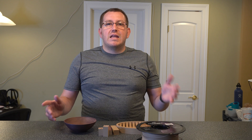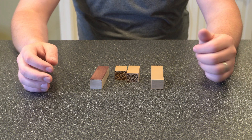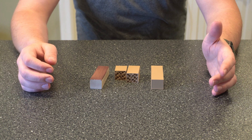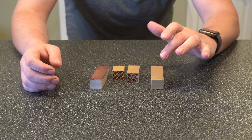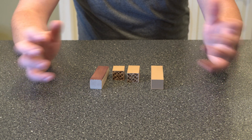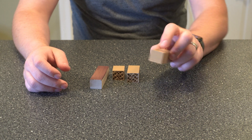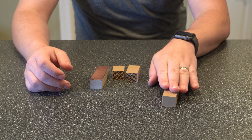Make sure you guys hit that like button and subscribe. The first example I have here is three rectangles. They're all printed on the same batch, standard PLA print settings, 0.2 millimeter layer height. I've got two layers for the shell thickness, and really everything else is just standard for a PLA print. This one right here is completely untouched — took it straight off of the build plate. I wanted to show you what it looked like without doing any work to it.